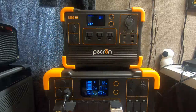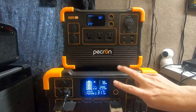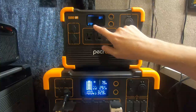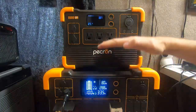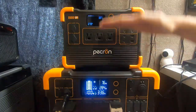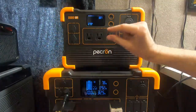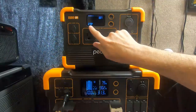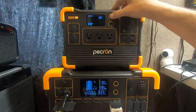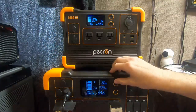The last one — 27.9 volts. For those who had version two or later of the other model, there was this same number. I call it the finalizing voltage. When you finalize a battery, you bring it up as high as it can go safely, and then it floats — trickling just a little bit to keep it at exactly the right voltage. You can change it: too high or too low are both bad. Put it back to 27.9. Then if you hold the button one more time, it'll say EEP — same as on the other model — meaning you're done.